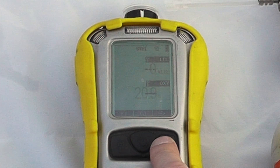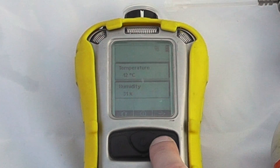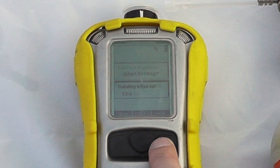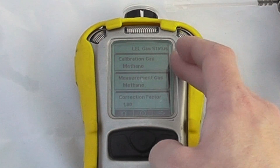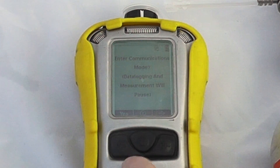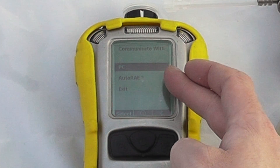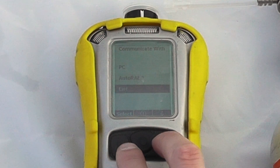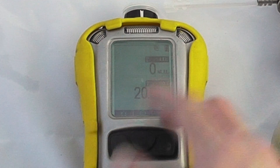In the back menus we can look at peak measurements, minimum, STEL, TWA, time and date settings, temperature settings, battery settings, and current runtime. We can start any enabled data logs, view calibration gases and correction factors, and enter communication mode — which allows you to interface with a PC or the AutoRAE calibration station — or exit.